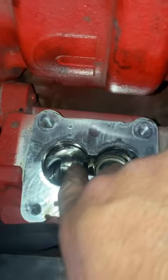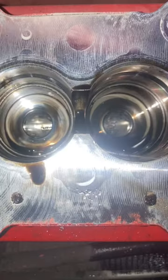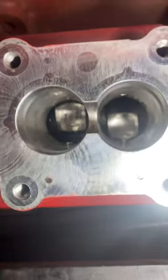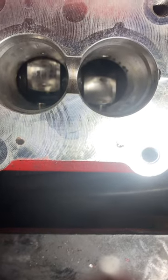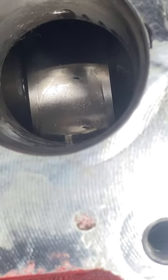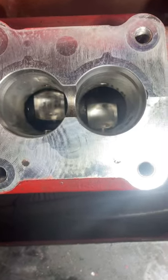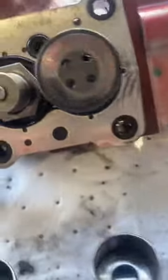Then you want to look down at your camshaft and inspect that for the same thing. It's difficult to see — let me get a better angle. As you can see, it looks like there is some damage to that roller in the front of the engine. And that one on the rear as well. So this is with the rollers removed — that's the camshaft, this is the base of the pump, and this is the head of the pump.